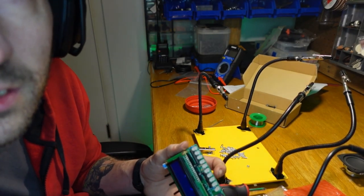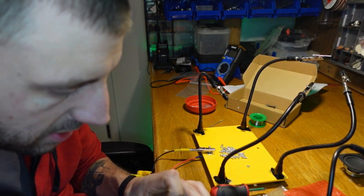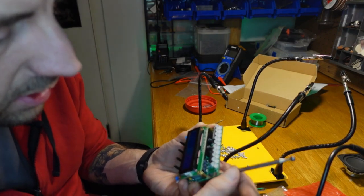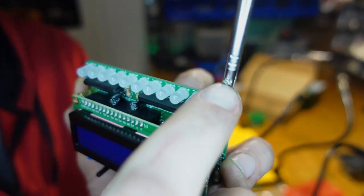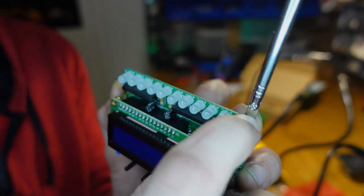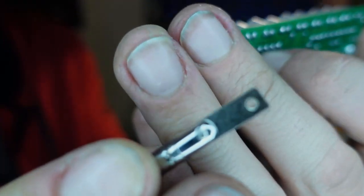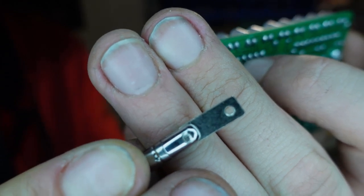That's not necessarily making a lot of sense to me. But it's basically saying to solder it, but 5 millimeters away? Oh, I think I get what it's saying. It wants 5 millimeters between the base of the antenna here and the edge of the PCB, and it says to fix it by tin, not to put a screw in it, which it lines up with a screw, but the hole in the base there is not wide enough for the screws it comes with anyway.